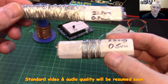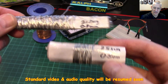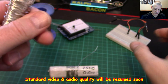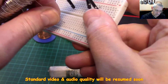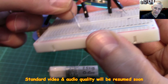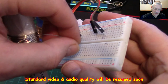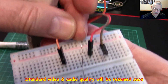I've got two samples here: 21 SWG which is 0.8mm, and 25 SWG which is 0.5mm. The larger 0.8mm is actually quite chunky — certainly thicker than you'd get on most components unless it's heavy duty. It does go into your board nicely though. The 0.5mm is closer to the size you'd get on most components, and it goes in just as easily — in fact easier because it's not so thick — but it's just a tiny bit light.